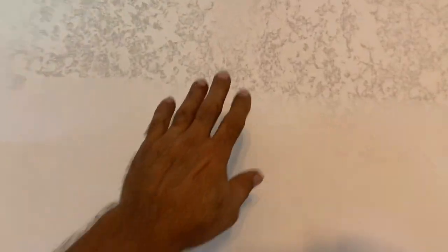So we knock down a little bit more with the knife, get all the little high spots down. Then I'm going to prime it first because this is raw drywall, so you really do need to prime it. And then it'll get at least one coat of a good paint and primer paint. Now it's all tied in, it's painted. Got to let the paint dry, but it's looking really good.